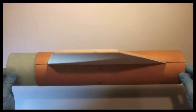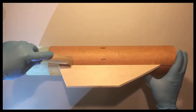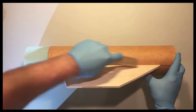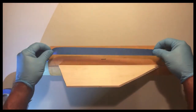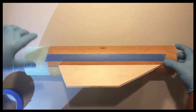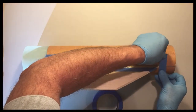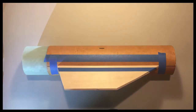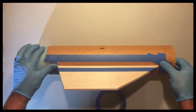Let's go ahead and apply epoxy to this fin. Most people would be surprised — I use a quite large dowel to form the fillet. The first thing I do is score the fin and the airframe just to use as a guide for applying tape around the area where I want to put the epoxy. The dowel size depends on the airframe: I'll typically use a 1⅛ inch dowel for a 3-inch airframe, maybe 1¼ inch for a 4-inch airframe, and about 1½ inch for a 6-inch rocket. A large dowel gives a nice round radius, which improves the strength of the tip-to-tip reinforcement cloth.